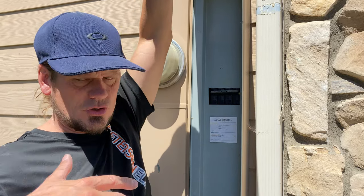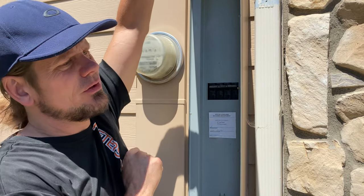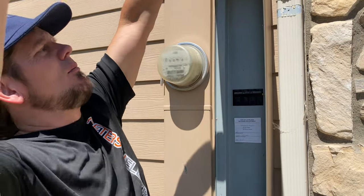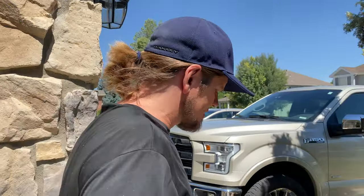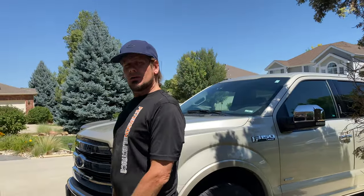This gentleman took photos from far back and close up as I asked, so I could see he had a 150-amp main on a 200 amp aluminum service — I felt he's going to be okay to charge on either the 80 or the 50 amp circuit. Could he charge both at the same time? Possibly, and that would cause an issue. But cars only charge at about 32 amps on one circuit and 70 on the other, leaving about 28 to 33 percent remaining capacity on that main breaker. If it had been 125 amps, I probably wouldn't have put both circuits in.